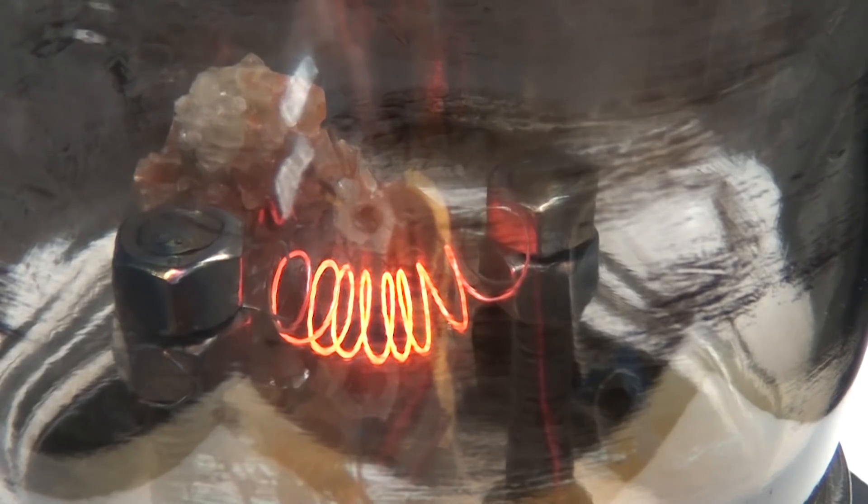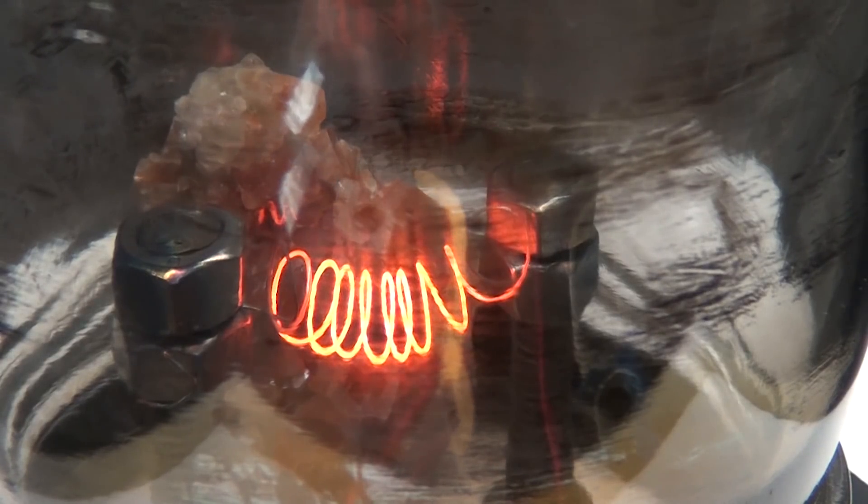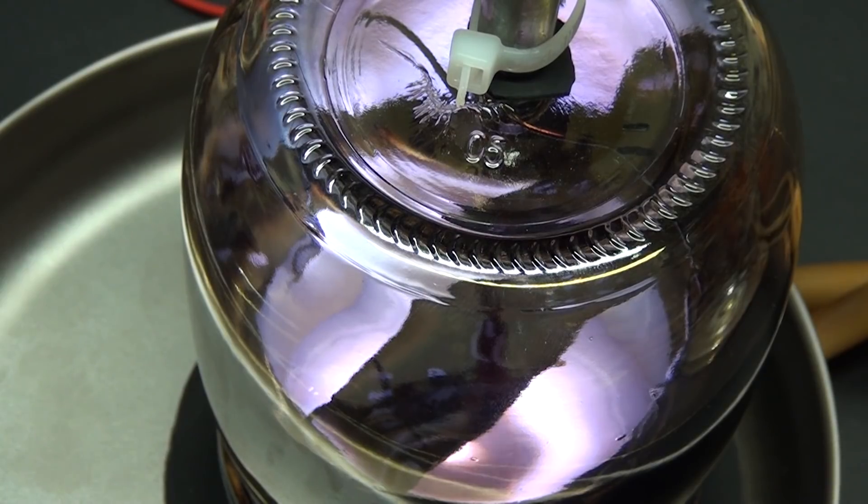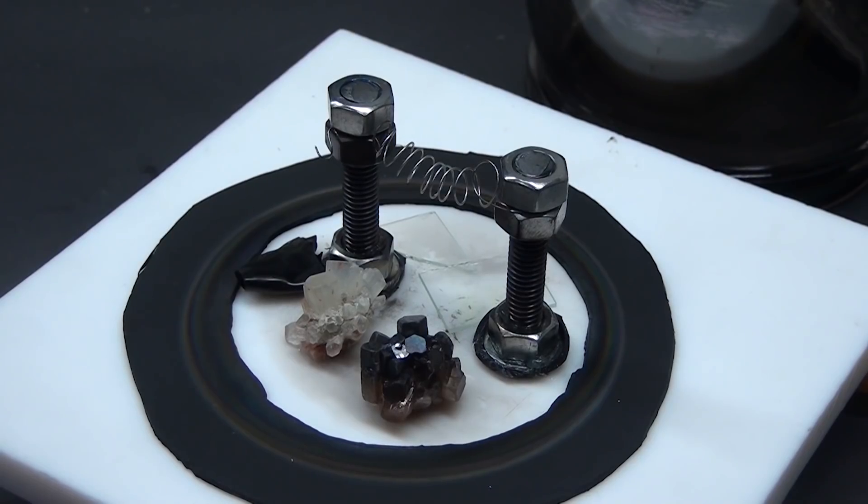As the wire passes 900 degrees, titanium vapor just comes flying off of the wire, coating anything it touches in titanium, which reacts away any gases floating around. The reason this works is because in a vacuum there's no oxygen to form a protective layer over the surface of the titanium and no gases to prevent any metal that evaporates from flying away. So the hot wire just sprays titanium at everything in the chamber. When I read that my brain ground to a halt. All this time all I wanted to do was titanium coatings, and all I had to do was heat up a wire under vacuum, so I threw together this little prototype.